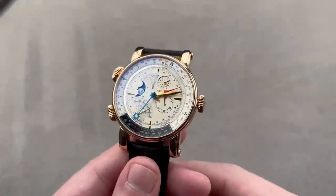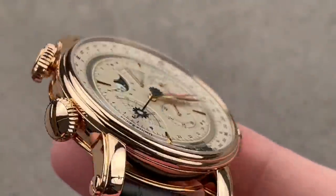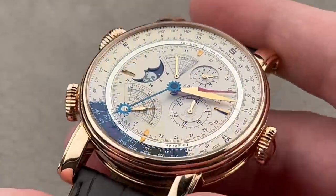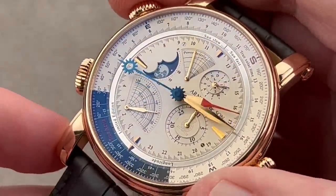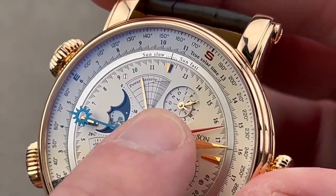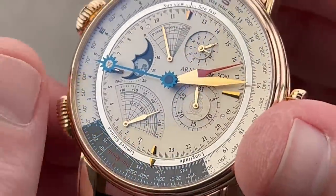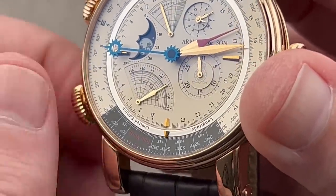Now, something very complicated — and I do mean very complicated. Launched in 2005 in 50 pieces in rose gold, with also 50 in white gold: this is the Arnold & Son True North Perpetual. 45 millimeters in rose gold, with welded-on lugs, straps fixed by screws and bars, a running equation of time as well as an indexed equation of time, a perpetual calendar with a pointer date, coaxial leap year and month, and a power reserve indicator for the 7-day manual wind power reserve. You can also set the longitude at the bottom.